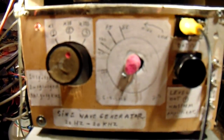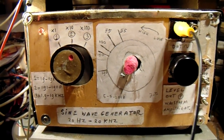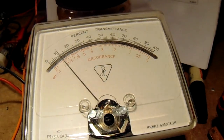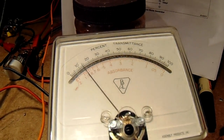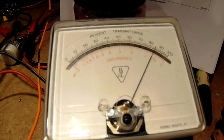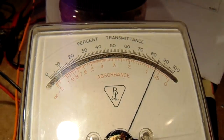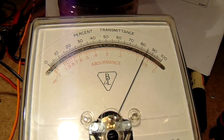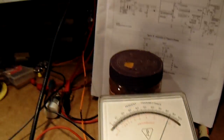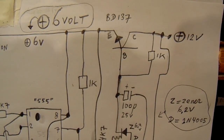At the moment my generator is producing 1.4 kilohertz, and when I turn the knob on the meter we go from 1.4 kilohertz up to 19 kilohertz — so this is the highest frequency band the meter can handle. You need a good meter and will have to draw three scales. A big meter with a big pointer is ideal, and the scale will need to be redrawn completely.